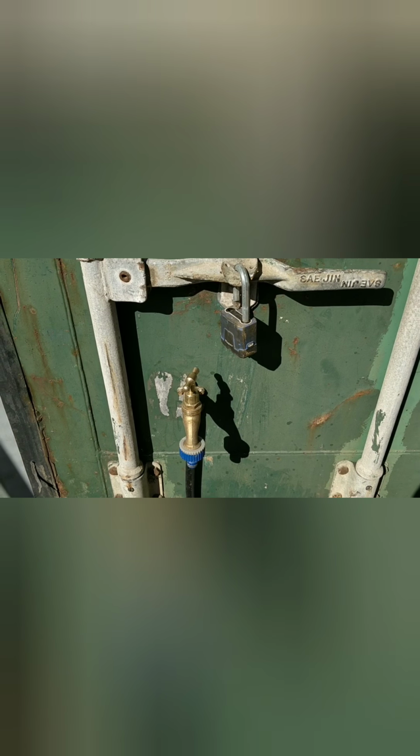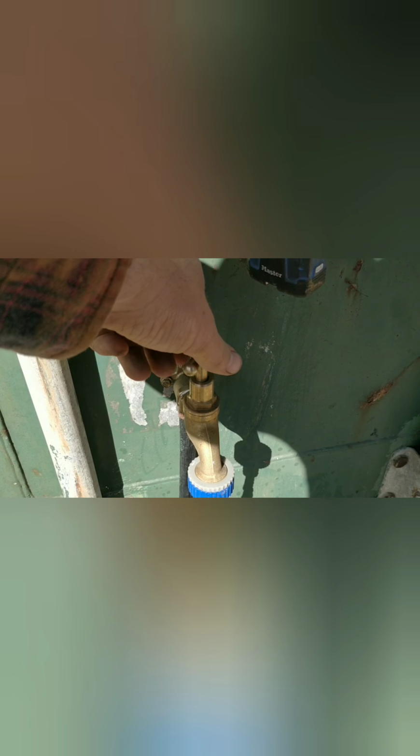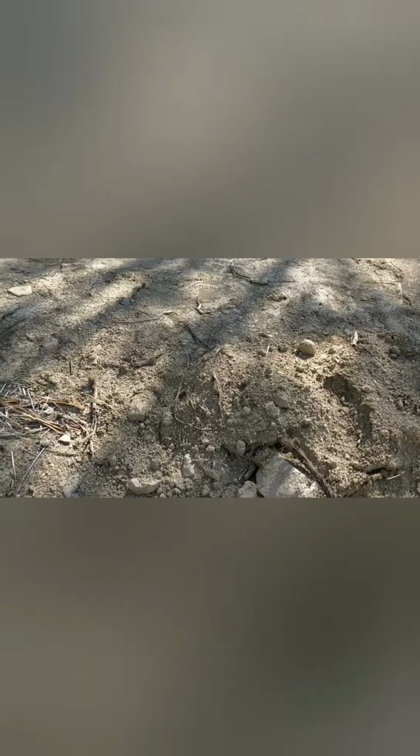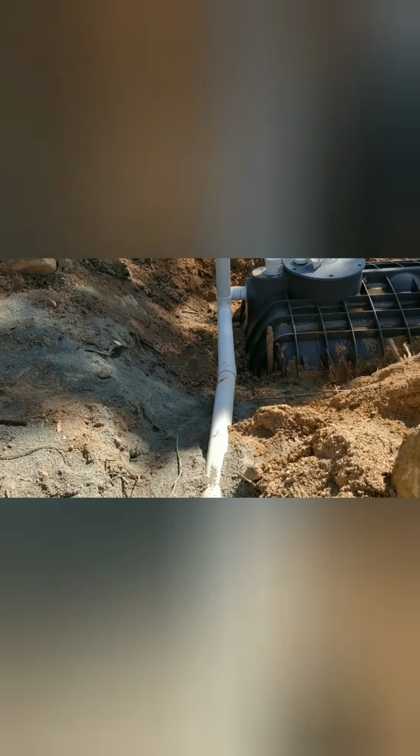And because it's got an S-bend for a water trap to keep the smell out, and has a tap above it to make sure that S-bend stays charged with water. So our line comes here across the road, comes through. Again, in Australia the spec is about a 1 in 65 drop.